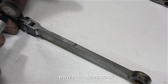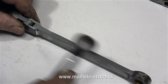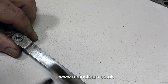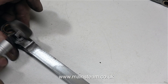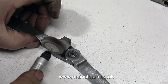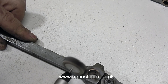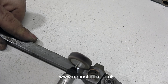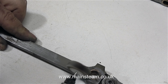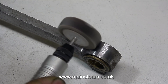What I'm doing is removing quite a lot of metal because it's not finished off in this area — this is the back of one of the rods. Doing a job like this takes a surprisingly long time, and longer if you just use wet or dry sandpaper; I would use 400 grit. Using rotary tools is a really good idea, particularly the Proxxon rotary tools which go really fast and are very powerful. But only apply very light pressure and let the flapper wheel skim over the top of the work. If you need to remove metal — for example where there are lots of file marks and scratches — just apply more pressure, and instead of lightly cleaning you'll be removing quite a lot of metal. You can hear the difference in the sound of the tool.